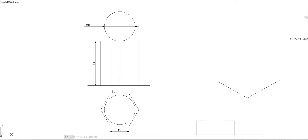Since it is a hexagonal prism, first you draw a hexagon of 25 mm base edge with one base edge parallel. Then project all these points to the base reference line and draw the front view of the hexagon also. This is the top view of the hexagonal prism and this is the front view of the hexagonal prism.